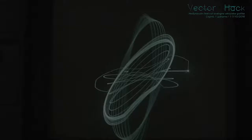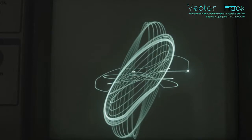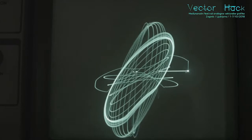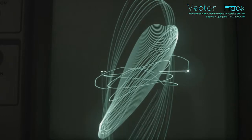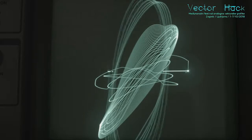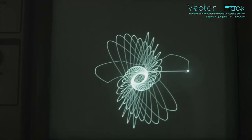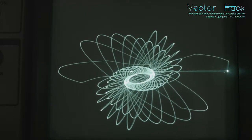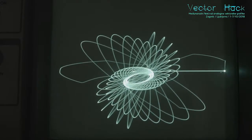Yeah, so this was a project out of a German magazine, Elektor. It was called the Spywriter, and it was a very simple project that has a few audio op amps in it and a synchronization oscillator, which, like the oscilloscope graphic artist, has a synchronizing pulse. But it can do these sort of spirograph figures very easily. There are only 6 controls on here. There's CV. Yeah, there's CV in it.